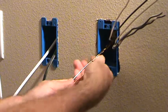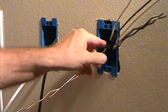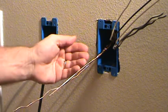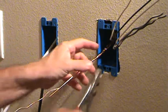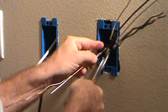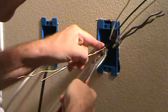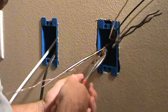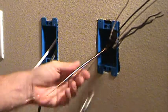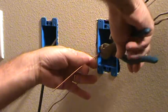Another ground cap — when you do electrical work, you've got to have those ground caps because this is how you do these ground wires. This is the quickest and easiest way. You could put a wire nut back there, but then you'd need a pigtail with four wires and a big wire nut, and I don't want to fill the box up — if I fill that box up I might have a hard time getting the plug back in.